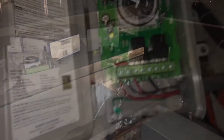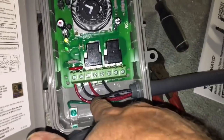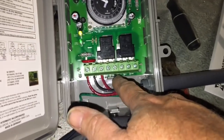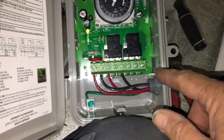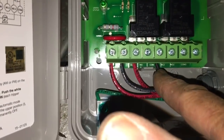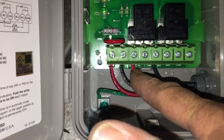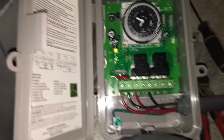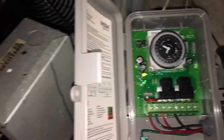I did some pre-wiring down here before I mount this up. I'm gonna go L1, L2 straight in — no jumper wire over to common, because the thermostat leg I'm gonna tie this to already comes off the hot through the thermostat. I'm gonna grab this to the common on here, and then out of the normally closed to the coil on the contactor. We also got our ground because we're running a non-metallic flex.